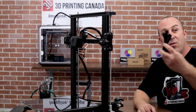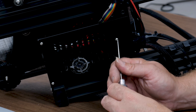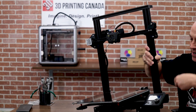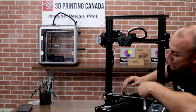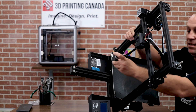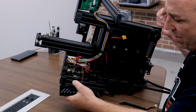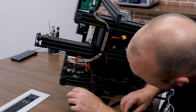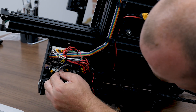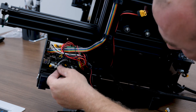Now we'll move on to the next step: installing the braided wire as well as the motor cable to the board. We're going to go ahead and open up the board with a 2mm driver, and there's one on the top of the board here. Be careful when you take your board off that you don't rip these wires. Now we're going to locate X, Y, and our Z motor. If there's some hot glue on there, be careful that you don't rip out the plug.